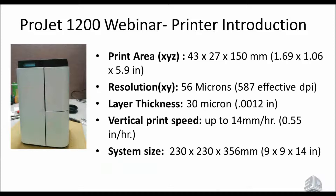The next field is prototyping, and the ideal materials here are clear and gray. They give very sharp corners, a rigid material, and — if you choose the clear — it's transparent. Both build very fast. Companies interested in this include connector companies and micro-injection molding companies. As you can see in the picture on the top left, these connectors have square holes going through them, which would be very difficult to machine or mold by traditional methods, making this ideal for prototyping complex parts.